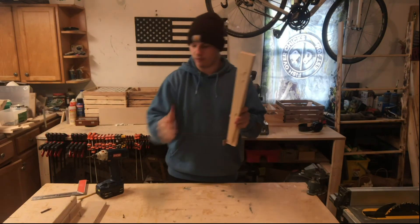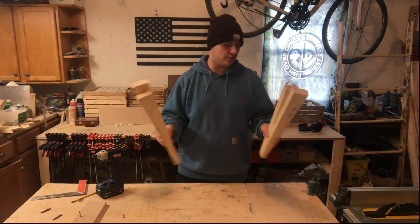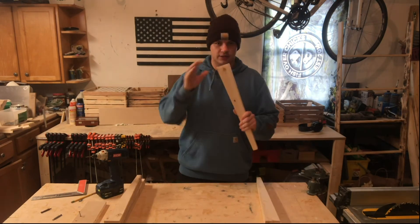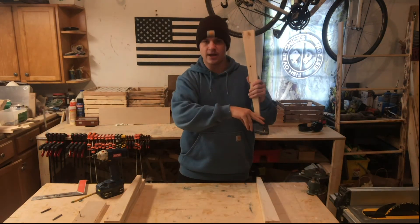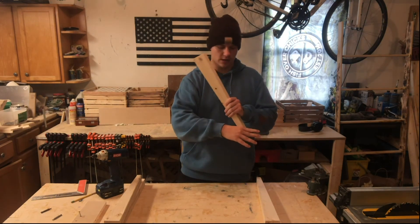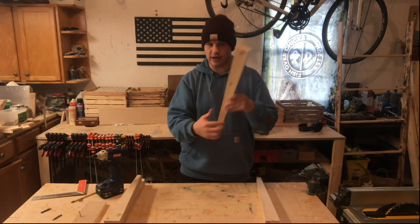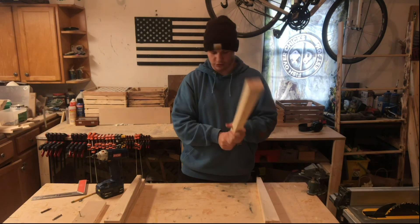There's two of them and of course you've got to do that twice to get all four legs, but that is how you do it. It's a very easy way to make table legs look really cool. To get that diagonal look, you just cut the top and the bottom at the same degree angle — so whether it's 15 or 20 degrees, you cut both at the same angle. Then I go ahead and round all the edges to make them look really nice, but that is it for this tutorial.